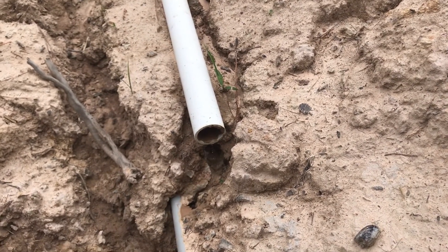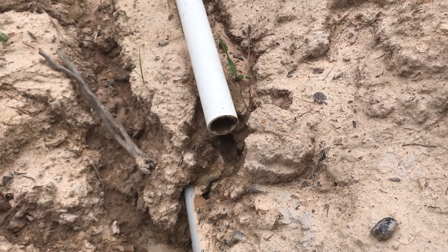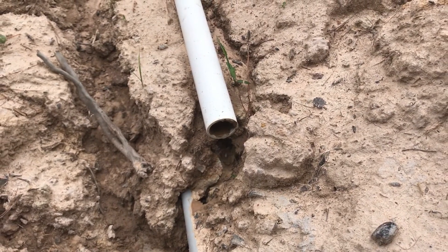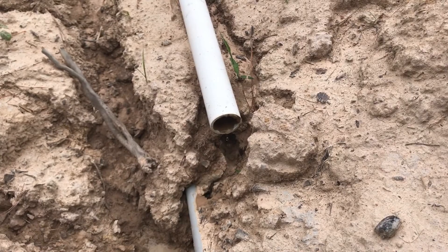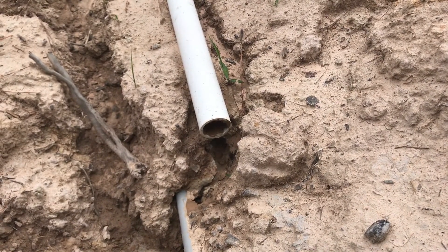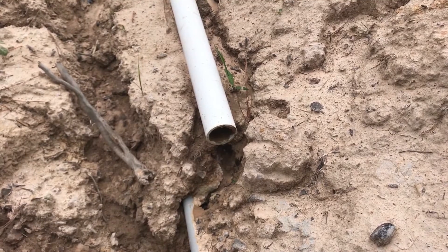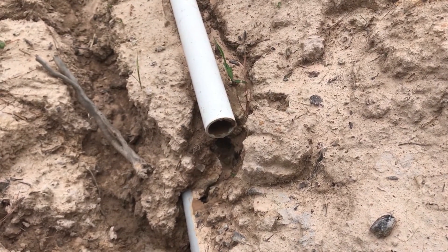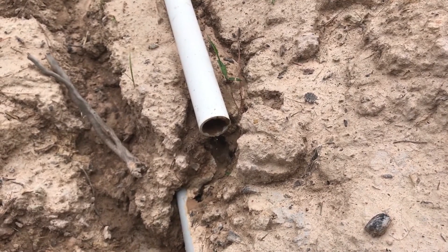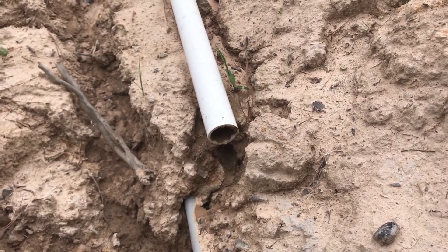If you recall when I talked about the plumbing, we didn't want any of the air conditioning condensate running into the main sewer system. So we had a drain tied in with the shop sink, which will also be the fish tank sink. All that excess volume from my wife's fish tanks and from the air conditioning condensers will go into a separate tank that will be sprinkled out intermittently — similar to a septic system but separate from our actual septic, so as not to cause an imbalance from high water flows. Walking out here now, the p-traps are all filled up and all condensing units — the conventional unit and the two mini splits — run into this pipe through the internal plumbing and it's dripping out on the ground. We'll eventually plumb in a tank, but for now it's just open-ended on the ground so we don't have a muddy mess. That's a steady stream!